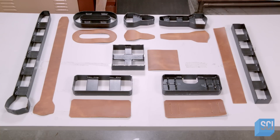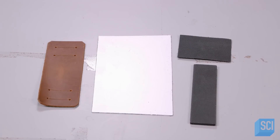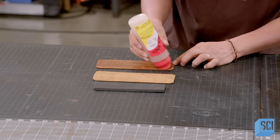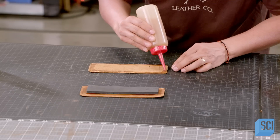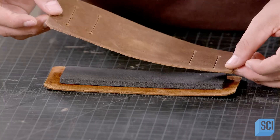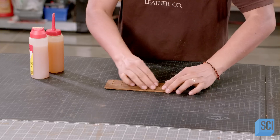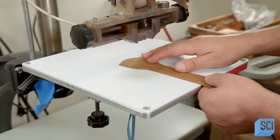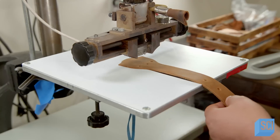The clicker works by applying 25 tons of pressure to custom-made dies. The shoulder pad is one of 22 pieces of leather that will complete the bag. A craftsperson glues a foam rectangle between two layers of leather — this type of glue won't bubble in hot temperatures. Chrome-tanned hide is tough stuff, so manufacturers use a heated stamp to brand the leather with their logo.